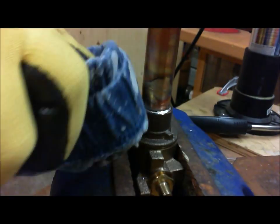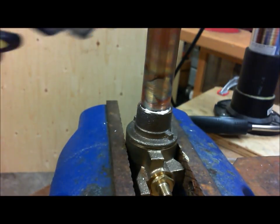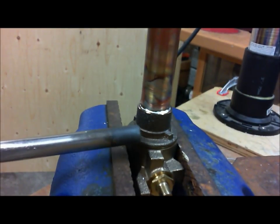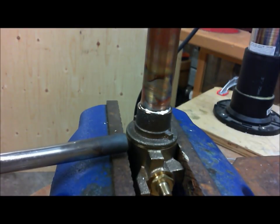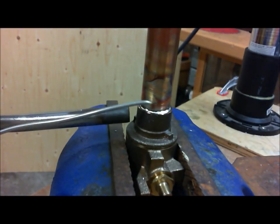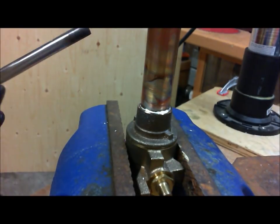Now, the initial shaping of that joint may look okay, but I'm just going to reheat it, and you can still do this. But be very careful not to burn or melt anything now, because this is still warm. Remember, there are some seats down here for the Teflon seats within the joint, so do not overheat it too much. Now, if you look at this, you'll see that we ended up exactly where the 3/4 was, and the capillary space between the socket and the tube is nicely finished. So let's go back again.